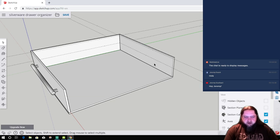So if the width here is, I already forgot the width. What was the width? 17.75. I want to go about 1/2 inch shorter than that, so 17 1/4. Yeah, I'll go 17 1/4. The problem is I don't physically have this drawer. I mean, it's not really a problem, but I can't test fit this once I put it all together. I may end up building a box out of like cardboard with the same inner dimensions that I was given, so I can test fit the wood pieces as we go along.